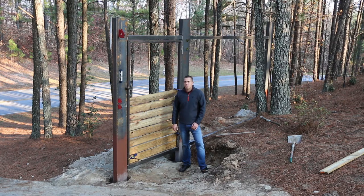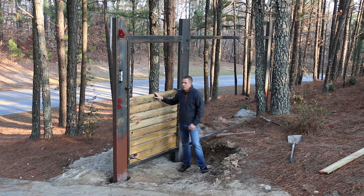Next, now I've got my spacing set, I need to make my vertical supports. I'm gonna use a 1-inch C-channel behind the larger open sections on either side, and I probably will put one in the middle here and in the middle of the other 5-foot space on the other side just to give it a little extra support. I really think it'll be fine, but might as well do it now.